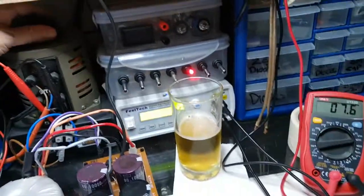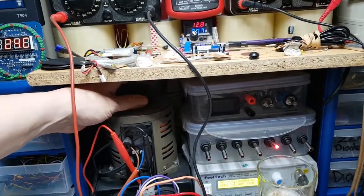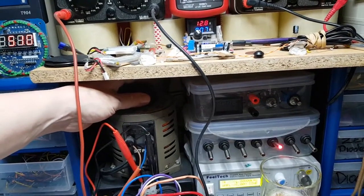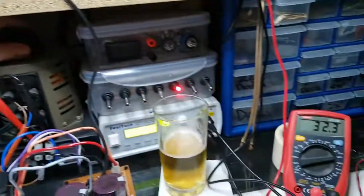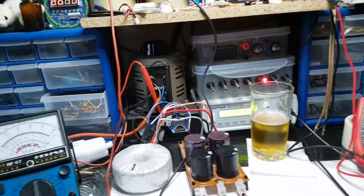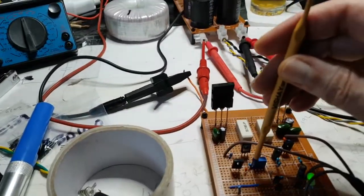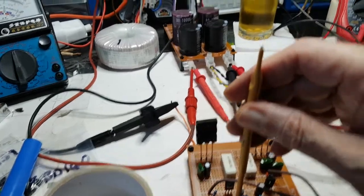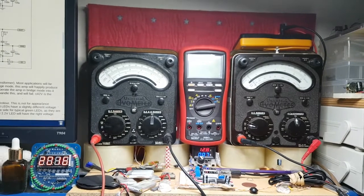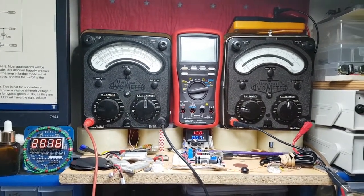And as we're going up on the voltage, that's nice, we're at 11 volts. That's not doing a great deal. I'm going to take it up to around 40 volts and just start twiddling that bias. So I'm on 35, that's good. I've got nothing jumping across doing anything absolutely crazy, which is nice. Let me just get the twiddly stick on here. And just start watching those meters over there. It just gently does this. I'm on 37.5 volts.